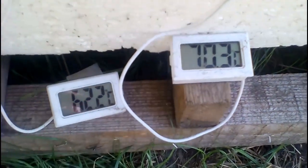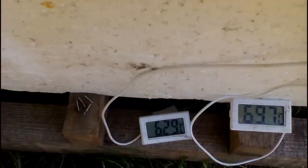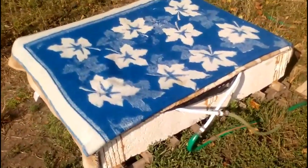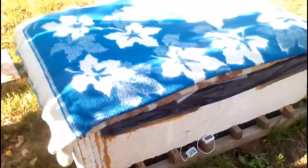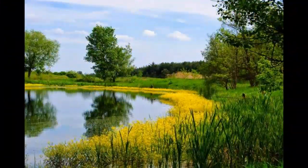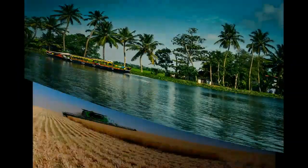Let's look at the case where that sheet of cellular polycarbonate is covered with 2 glass sheets, and this is the temperature in the evening. It is obvious that now the water will keep its heat better, and this is the water temperature the next morning. If someone plans to take a shower in the morning, he can cover the solar heater with a blanket the night before. For example, if the water is heated to these temperatures in the evening, the water will have these temperatures the next morning after 16 hours under a blanket. I must clarify that all these experiments were done when the height of the water inside this black sleeve was 9 cm. We can come to the conclusion that decreasing the height of the water increases its evening temperature, but decreases its morning temperature. In addition, my experiments were done in the middle of Ukrainian August, when the height of the sun above the horizon was approximately 55 degrees at noon. It is obvious that the solar heater will work better in most southern regions with higher sun.